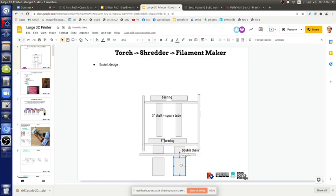Underneath this, you'd want perforated mesh, which determines the size of particles that get through. When you throw stuff in there, it keeps getting reground until it falls through the mesh under the grinders, and the hole sizes in the mesh determine what particles come out of the machine. We do have some mesh we can use for this, or we can get some more from McMaster-Carr.